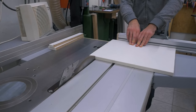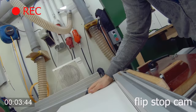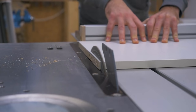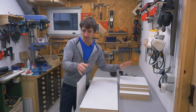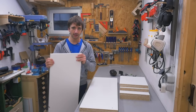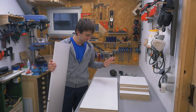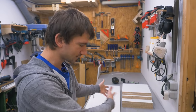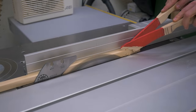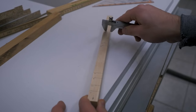Three of the cabinets are enough material for the new one I want to build, and I only need to cut the pieces to a new length. I have all my pieces cut. The scraps are nicely organized and I actually have one wall left over — that's enough to screw up at least one part. What I essentially did is remove all the dowel joinery to assemble this again with dowel joinery. To drill the new dowel holes I cut a piece to the same thickness as the panels, made marks for the dowel locations and drilled them.